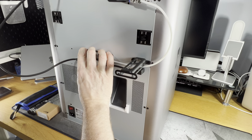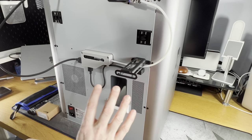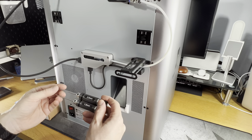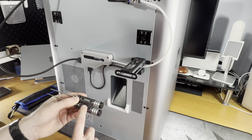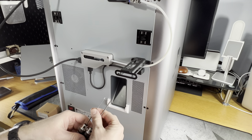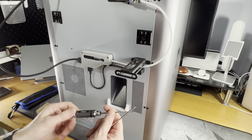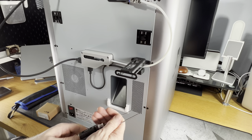So that's the plan for today. We'll start off with removing the feeder, the PTFE tubes, the cabling, the back cover, and the poop chute. That'll get us in at that board. There are two Allen keys needed: two millimeter and 1.5 millimeter. These are nice handy ones from Amazon — much more convenient than the Allen keys that came with it.